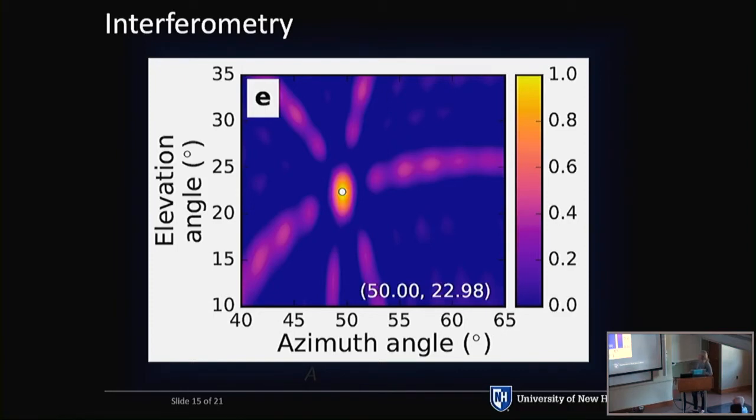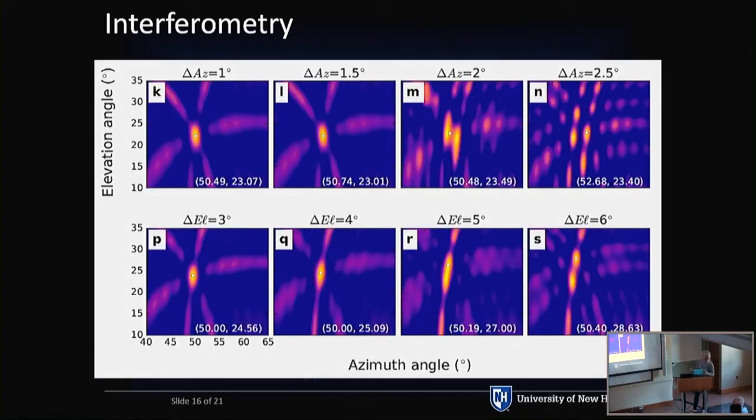To show you how limited our array's resolution is: the top row shows two point sources separated by various degrees in azimuth angle, and the bottom row shows two sources separated by various degrees in elevation angle. With our current processing code, we're still only locating one source at a time. We get what we call centroid shifting — we get an average location rather than two locations when we have a multi-source emitter. So our results are slightly skewed, but we can still do some interesting measurements.